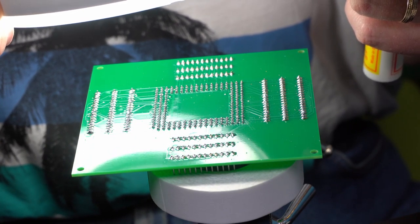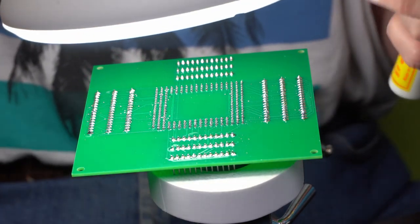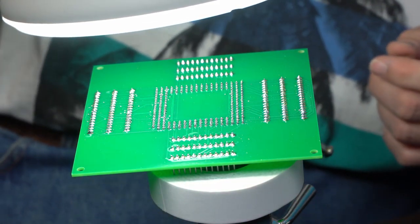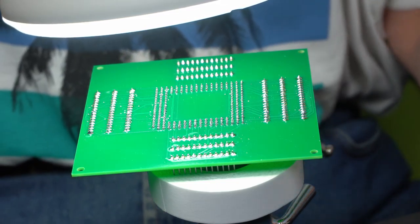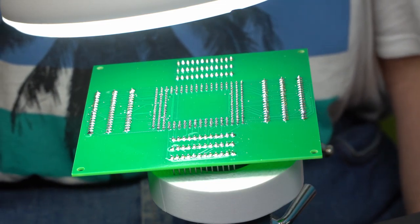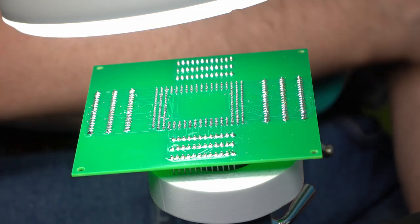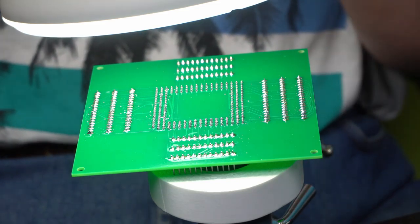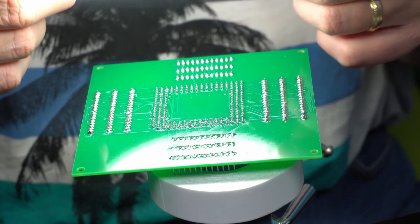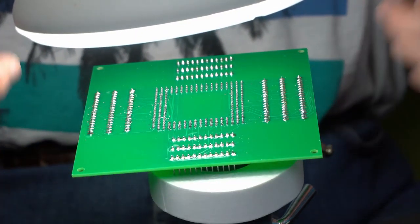If you have cold solder, then it looks gray. It'll look porous and a bit gray. And you should actually go back and add some more solder or remelt. And if it looks like there's a gap between the pin and the solder, then that also means it's cold solder. So one should look for the solder just flowing into the pin, like it's part of the pin. So that is cool.